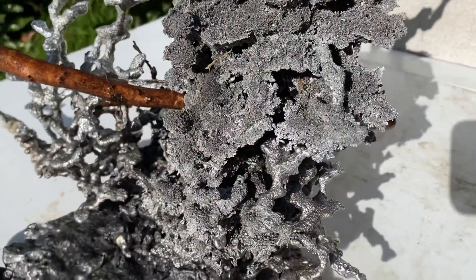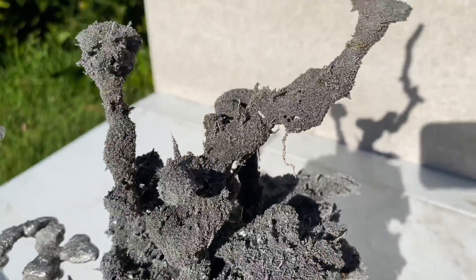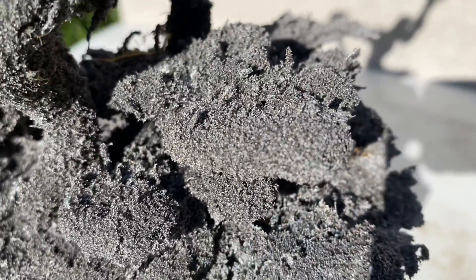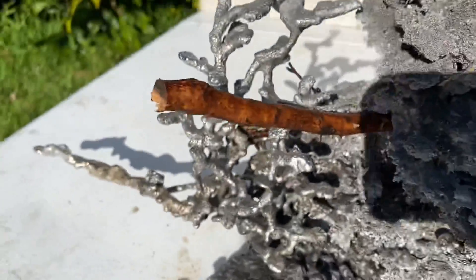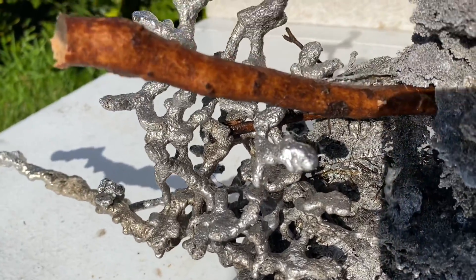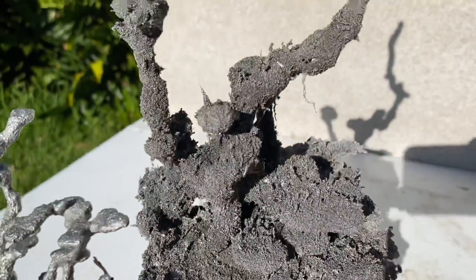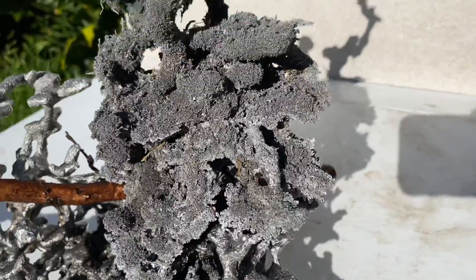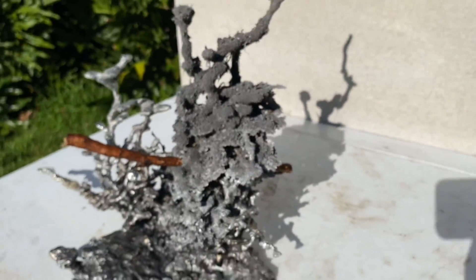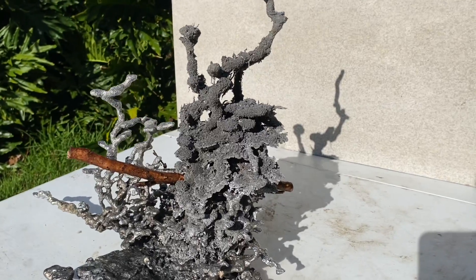Something neat I kind of want to show off is this is the aftermath of that explosion. You see how over here it's all rough textured — it looks like there are little sand particles just embedded into the aluminum. Over here is where the explosion wasn't, so this is more normal-looking casting. The explosion basically forces the aluminum into the sand, capturing little dirt and sand particles, giving it this sort of weird rough-looking texture. You can see how powerful that explosion was — it caused that entire side to embed itself in the sand.